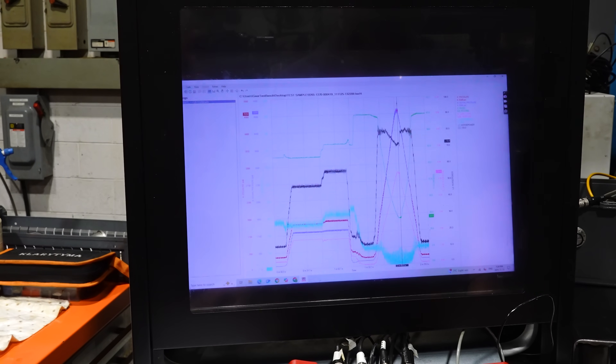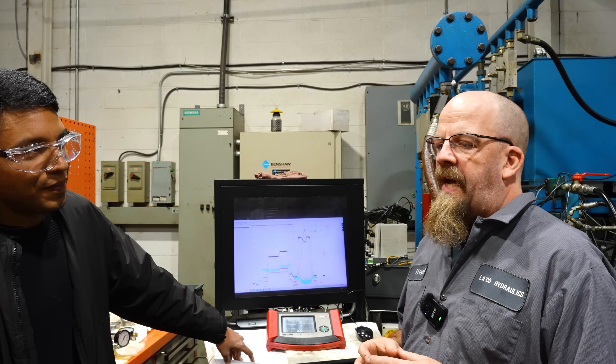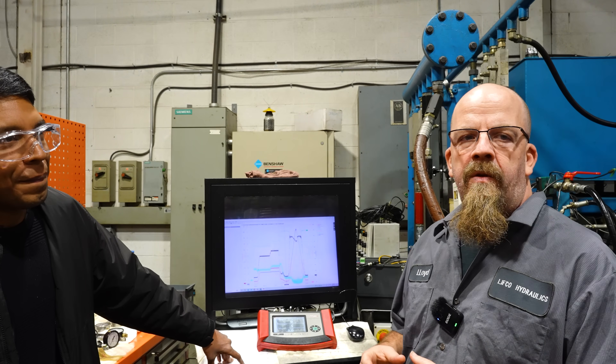The customer wants to make sure it goes to 5,000 PSI. We got 5,000 PSI, no problem — the pump is performing properly as it should. We just have to make sure what the efficiency is compared to a new unit to make sure it meets an acceptable standard. The customer was seeing 6,000 PSI. The question is: was it because the pump was ignoring a signal to stop at 3,000 PSI? We determined no — it was not ignoring. If you tell it to go to 3,000, 4,000, 5,000, or 1,000, the pump does that. So something was telling it to do the wrong thing. We have identified that the pump is not the root problem, though it has some symptoms of the problem. It's likely that contamination caused these signals to not function properly — there's a good chance this pump was being told to go to 6,000.